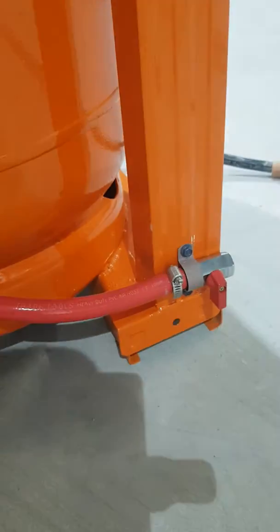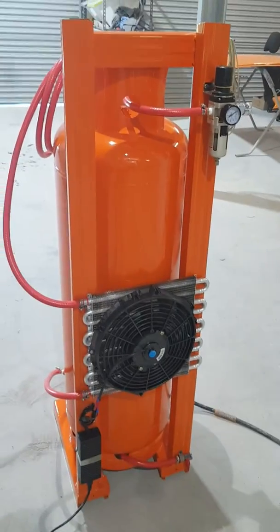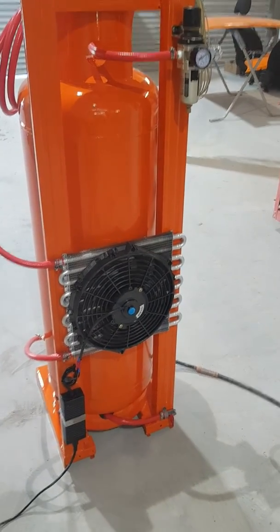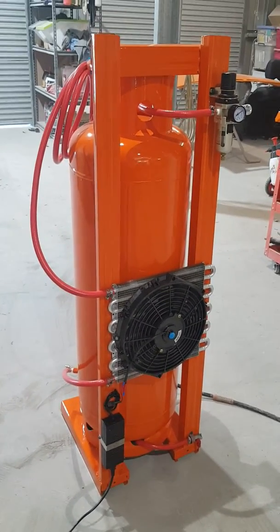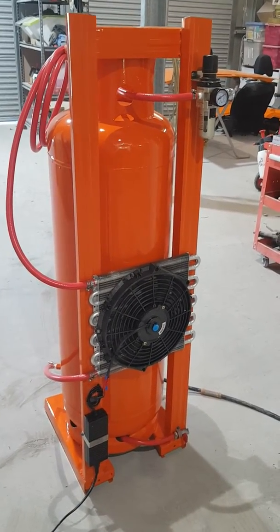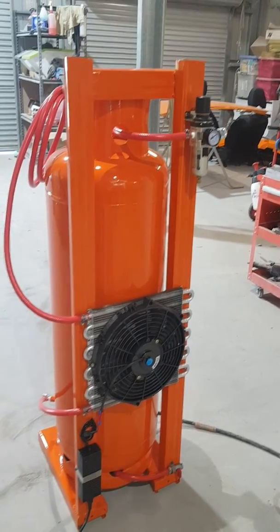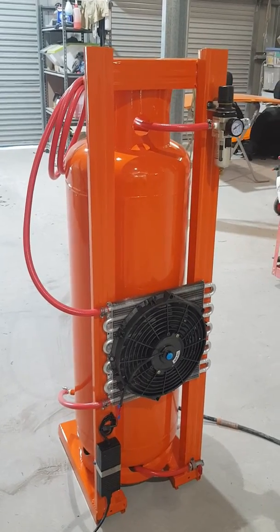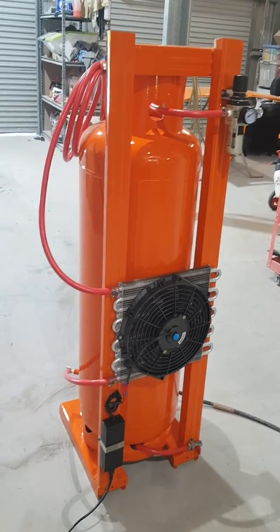That's just a bit hard to see, but underneath there it's just got a T-piece coming out, whereby it's hooked into the drain valve. So a system like this — if you end up with lots of moisture in your air, you're going to find it leads to imperfections in your paint work. Especially if your compressor is running constantly, which tends to happen if you've got a small compressor spraying a large job. If it's running constantly, the compressor runs very hot, you get a lot of blow-by — a lot of water gets blown straight into your air lines. You can put filters on the end of guns, but you still inevitably tend to get a little bit of that moisture coming through.